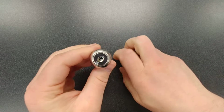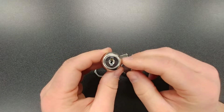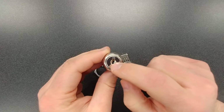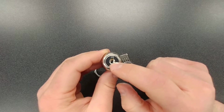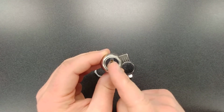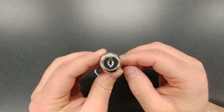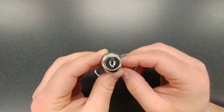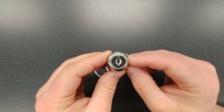Now, in a lot of applications for camlocks, especially outdoor use, you're going to find ones that don't have a little dust shutter on them, or even the ones that have the dust shutter on them, they're easily, from a key going in and out a lot, halfway open or a little bit open. And what happens is these wafers in here get really gummed up. They get corroded from all the weather, and it makes it almost impossible to use a key in them, right?